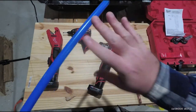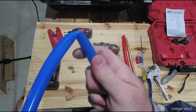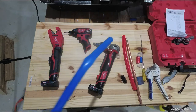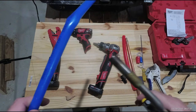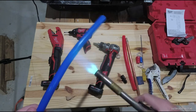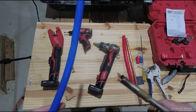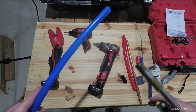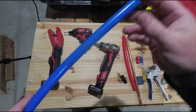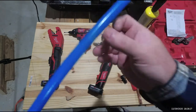Another cool thing about Pex-A — and I believe it's only Pex-A — is it has memory. You can damage or crimp this pipe and with other brands I believe it'll split and that crimp will always be there. But with this pipe, if you put just a little heat on it, it wants to get its memory back. As long as you don't crimp the hole in the corner completely, it will remember where it was, and once it cools off it should be just like it was and you've repaired that piece.